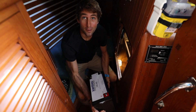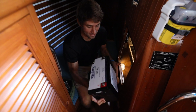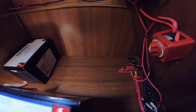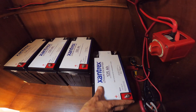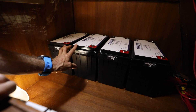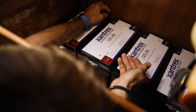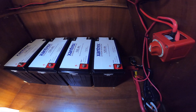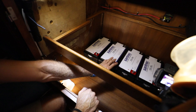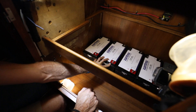I love how light these are. To get 125 usable amp hours out of our old battery we had to have a block and tackle to lift it — these are only 33 pounds each. So that's our four batteries placed, and now we're going to get ready to wire them up. This locker is really convenient because we already have a positive bus bar and a negative bus bar here. We rewired them with 4-aught cable so that it's totally overkill for any of the charging or draws that will come off these batteries, but it will also help with any voltage drop.